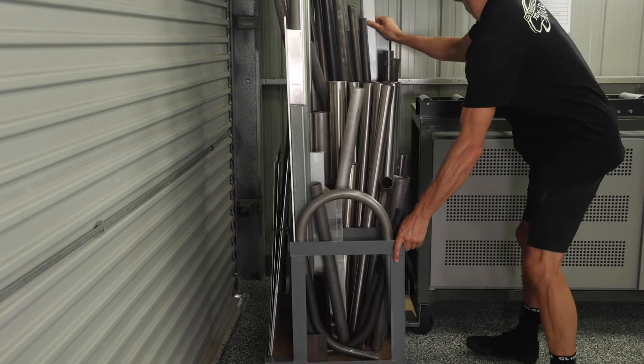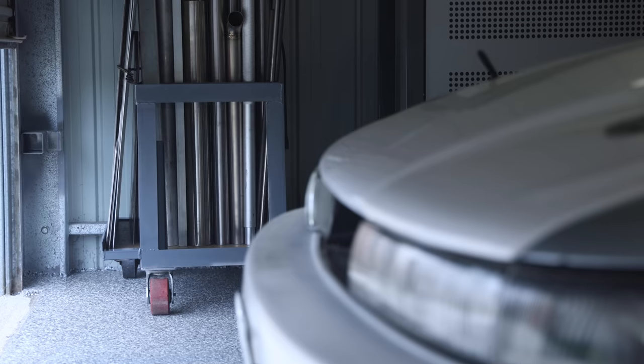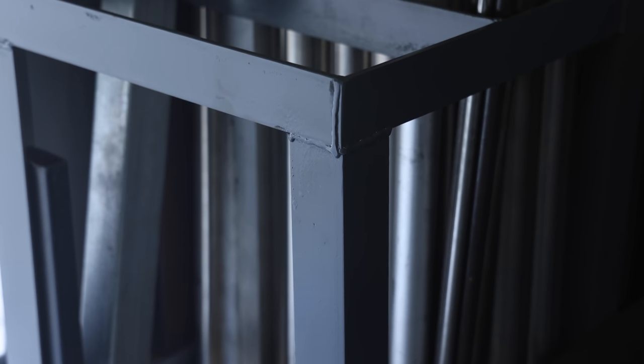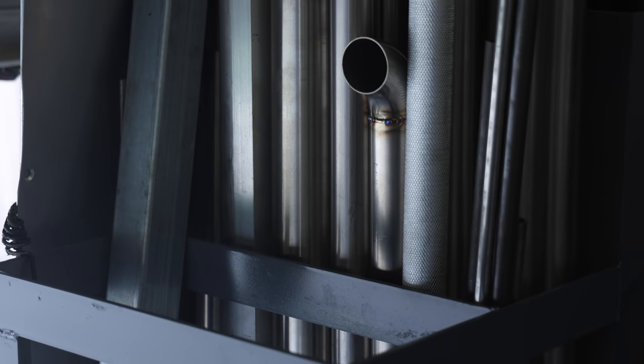This is really easy to shift around the workshop as it's on caster wheels, like a lot of things in the workshop. This little steel rack works really, really well. It's not great for huge lengths of steel, but anything around two meters long fits in it nicely. I stack the long lengths at the back, the short lengths at the front, and I've got a small section for sheet metal. These things get really heavy, so make sure you build it pretty strong. I built mine out of some angle iron and flat steel bar, around six millimeters thick.